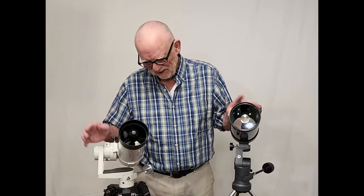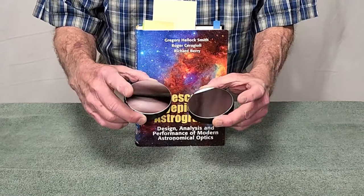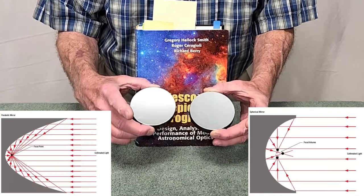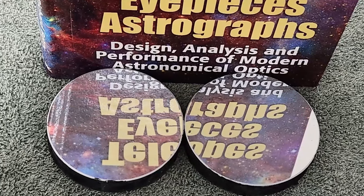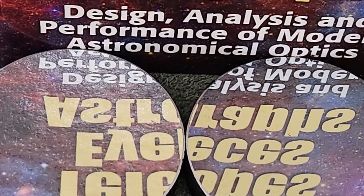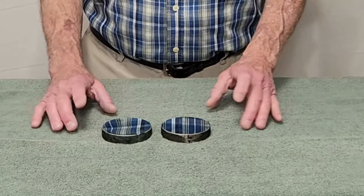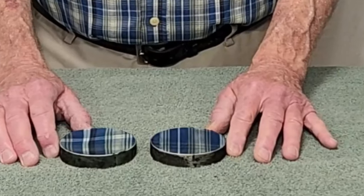The whole thing got me so irritated that I had to investigate and find out what the heck was going on. Suppose I've got two telescope mirrors here, and I tell you that one of them is parabolic and one of them is spherical. Can you tell the difference just by looking at them? Of course you can't. The only way you can tell the difference between a parabolic and a spherical surface on a mirror is by very, very careful testing. The cost to manufacture the parabolic mirror would be considerably higher — approximately twice.